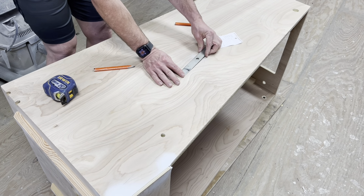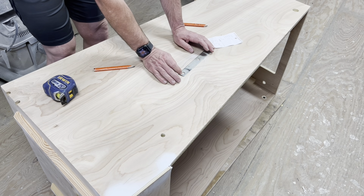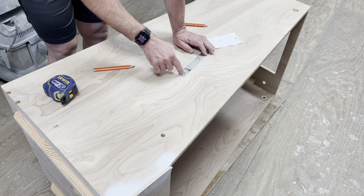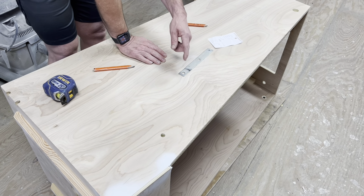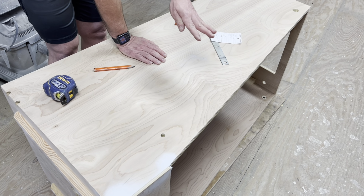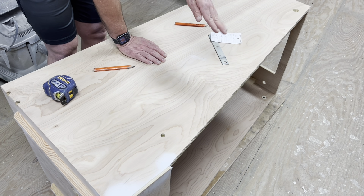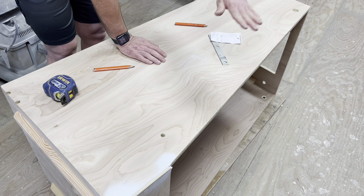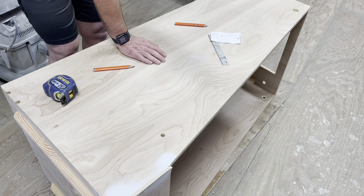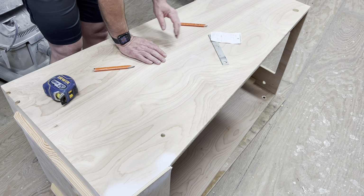And then I have this, just to make sure, because sometimes measurements don't always come out just right, so I find it a lot easier to use this as a template. The most important hole is going to be this rear hole. That's where the playfield actually sits and pivots, and this other hole is for the other pin that acts as more of a knockdown to unlock the lever when the playfield is erected into the upright position. So not as crucial, but we want to get it right.